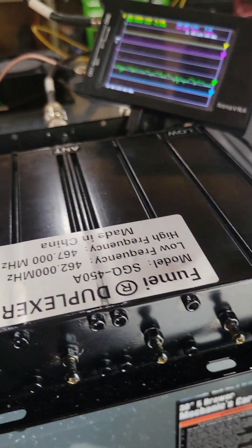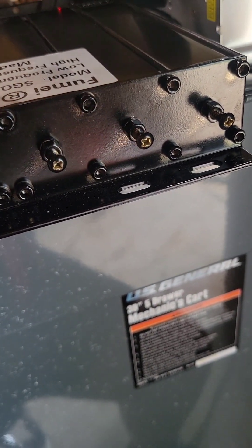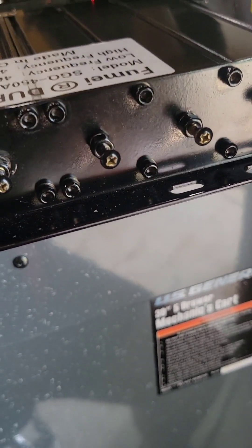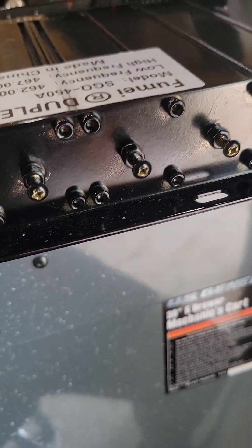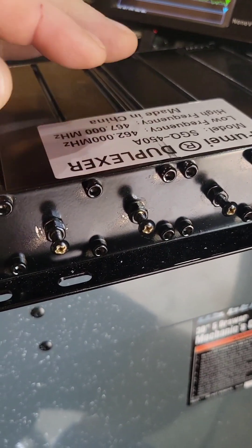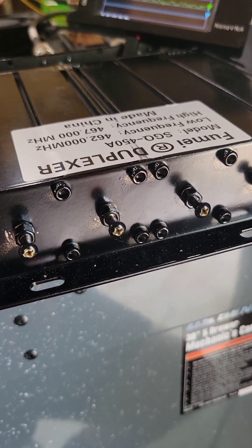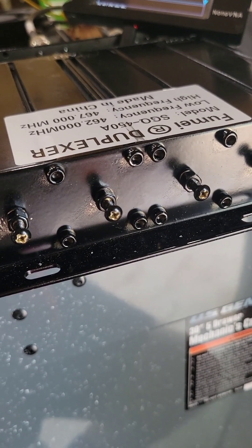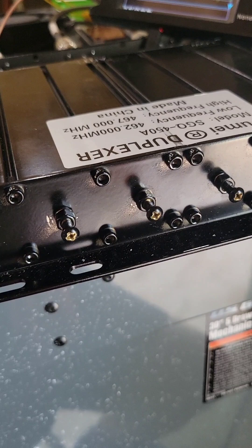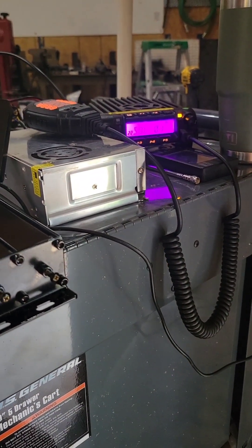Amazingly I have no signal on 467.675 getting past the low filter, out the antenna port, and into the receiver. I barely tuned these — literally it's almost like breathing on them, they're very coarse adjustments. That's how I've been tuning these duplexers. These aren't great duplexers; they work and you can make them functional, but they're not the world's greatest.